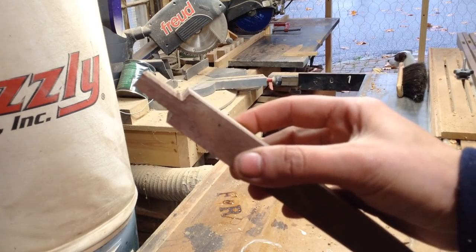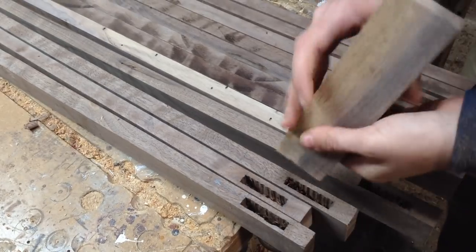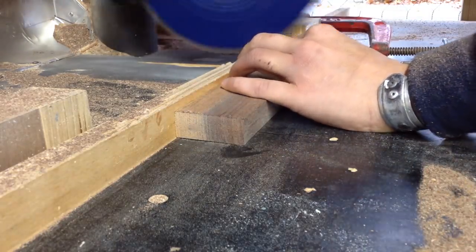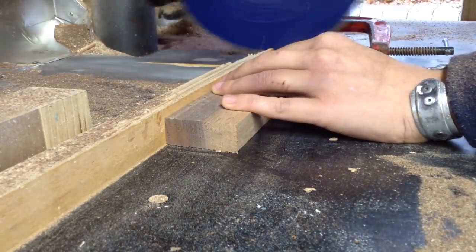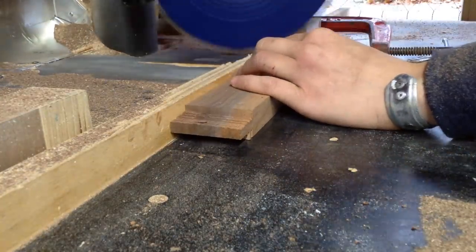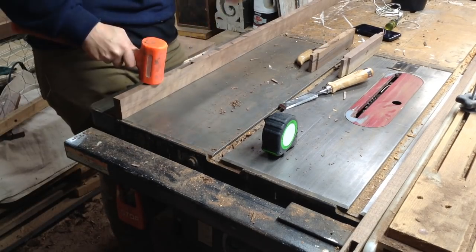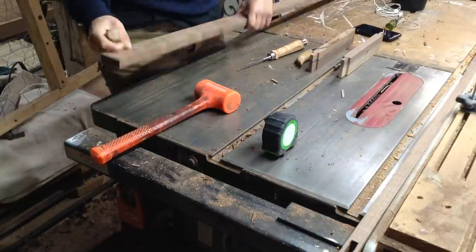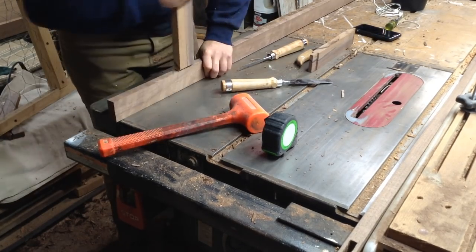I have a stop set up and cut a scrap piece with a tenon on it. I use my radial arm saw for these — I raise the blade and cut a couple scrap pieces until I get the thickness and depth just right, then go through and cut all of them. Cutting tenons is just a series of kerfs and then you clean up the kerf material. On the mortising jig, cleaning up by going back over with the machine is extremely tedious, so I usually leave the joints rough and clean them up with a chisel instead.